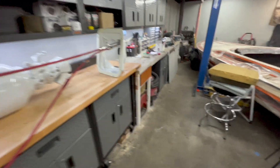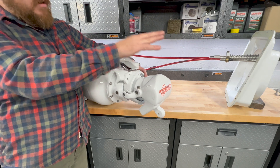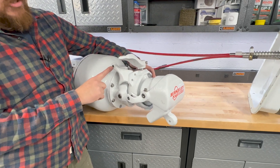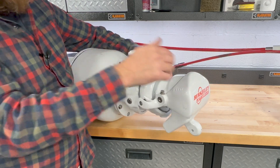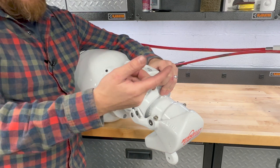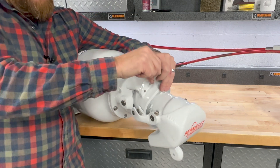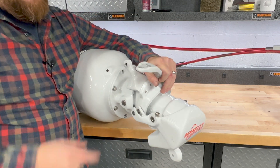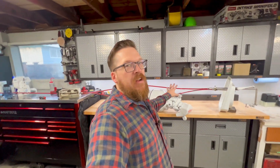On the nozzle itself — now that you've seen how the cable system works — this is pretty self-explanatory. This is the jetovator adjustment, which that white aluminum bracket bolts to, and the steering cable still bolts here to the steering arm to steer the nozzle. You can see how they operate independently of one another. You're going to run that electric motor, it's going to pull the entire steering cable through the transom, and pull the jetovator up or down as needed. When you steer the boat, you're only moving the inner part of the cable, which steers your nozzle.